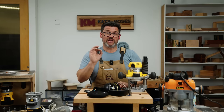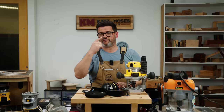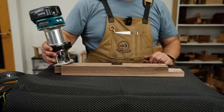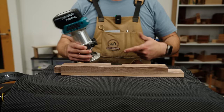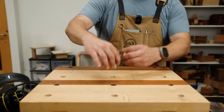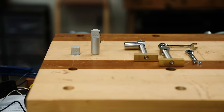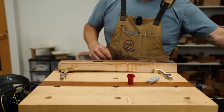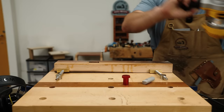When it comes to work holding there are three ways to do it — I'll link a great blog on our website down below. The first type is something like one of these non-slip pads. I wouldn't cut a deep mortise on this but I would do round overs all day on this — it's not going to go anywhere. The next thing you can do is bench dogs. They come in a variety of shapes and sizes and are great for any time you're working on the face of a board. For example, for a mortise, we could lock it in here with the vise, and that's going to allow me to work on this mortise — it's going to be super secure.